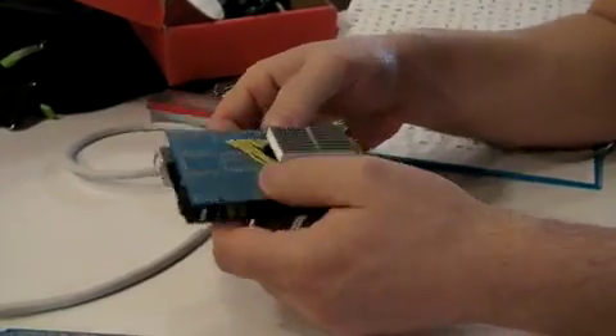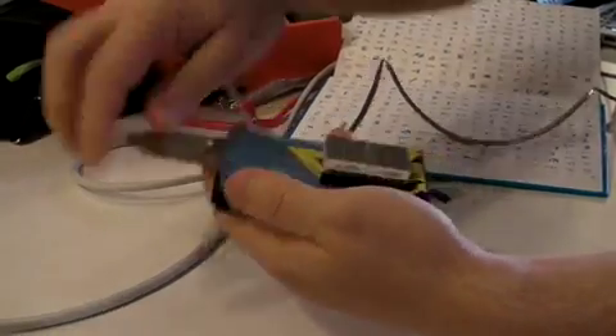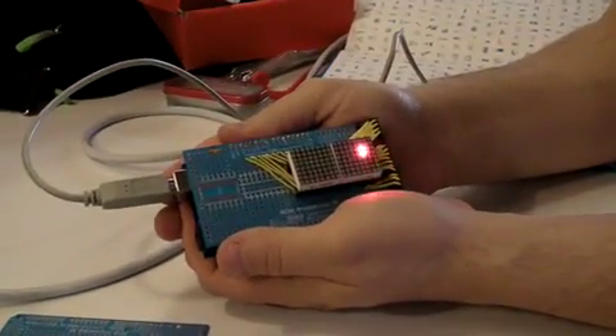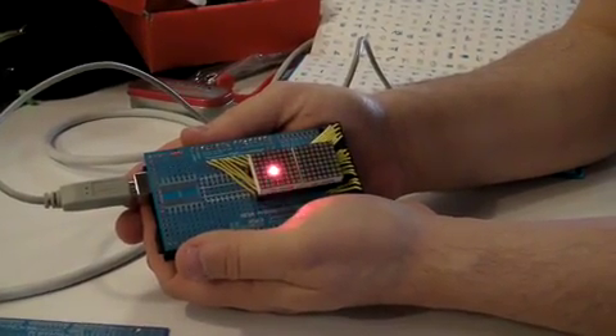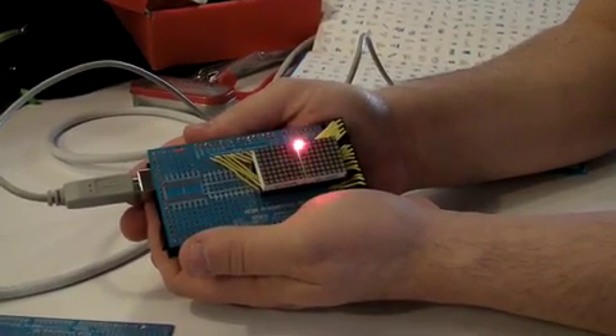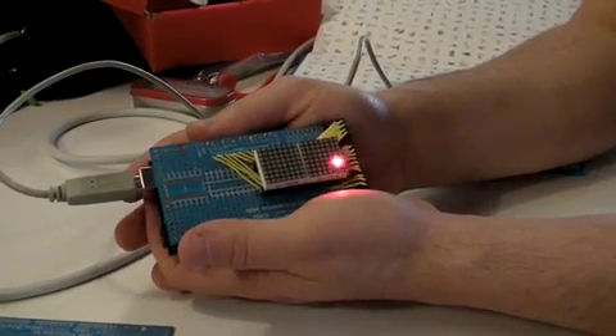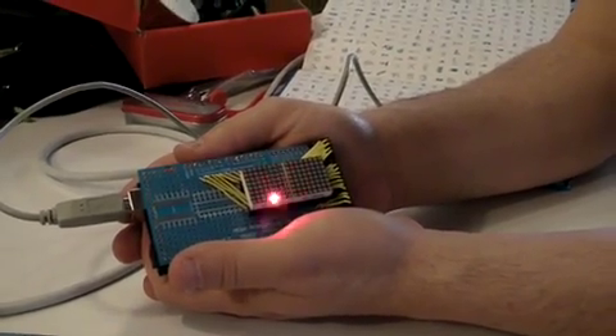Let's plug it in. It's all wired up, and when it runs it goes through a quick bit of test code to cycle through all 128 LEDs. You can go faster — I'm putting in about a 10 millisecond delay between each one. The Knight Rider is an example we love on the original Arduino, so I figured just duplicate the Knight Rider with 128 LEDs.